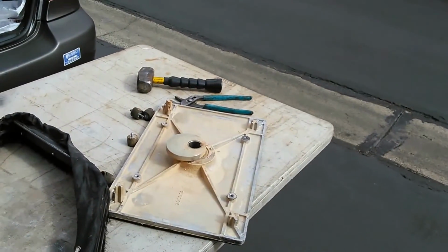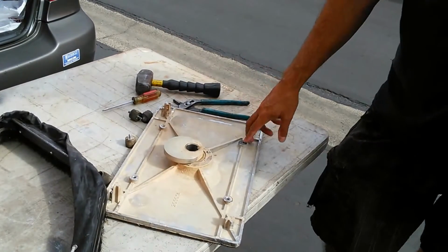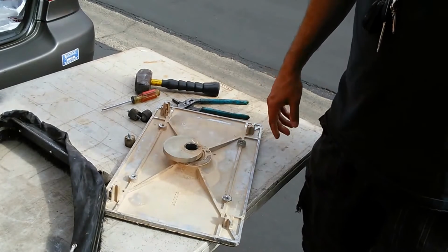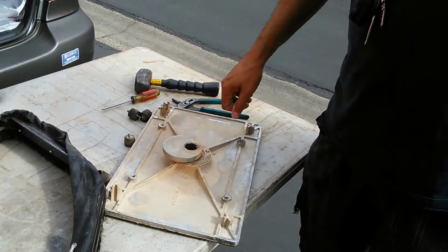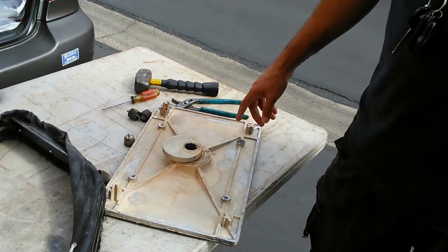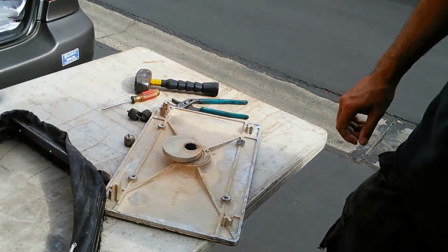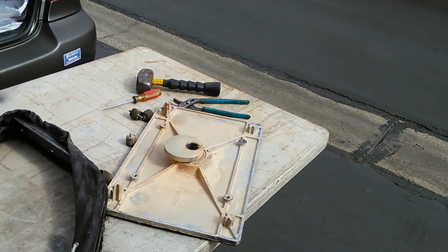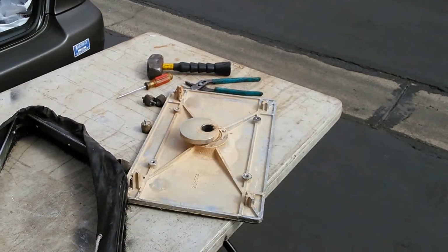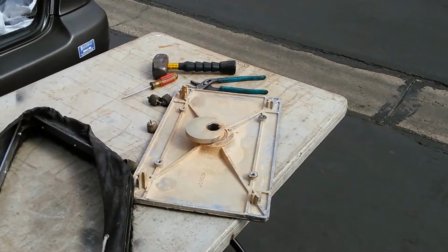So the other method is to drill out the middle of the stud. And if this is a hardened stud, it's going to take a while to do this. Drill out the middle of the stud and then get it with an easy out. Or just keep drilling until there's no more material left, and then just knock in the edges, and then it'll just collapse in on itself. So hopefully one of those two methods will get it. And either way, I might end up having to retap the hole. So I'll be back on camera once I have my solution in place.